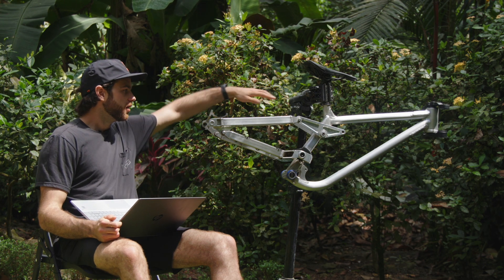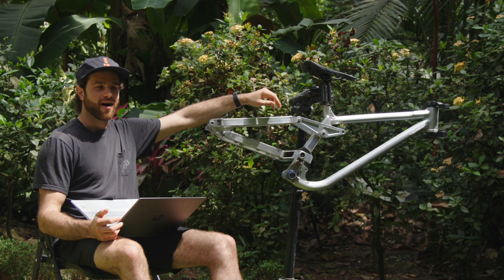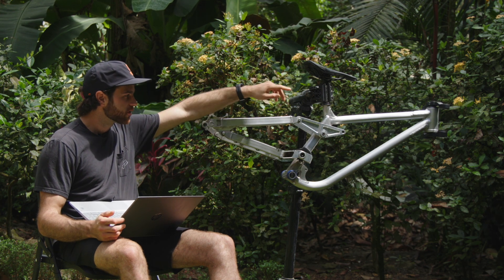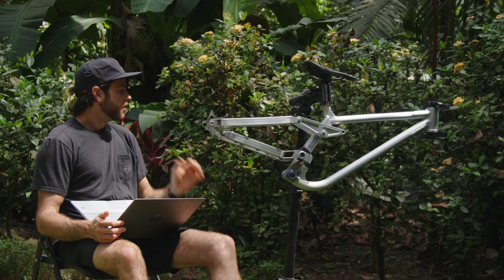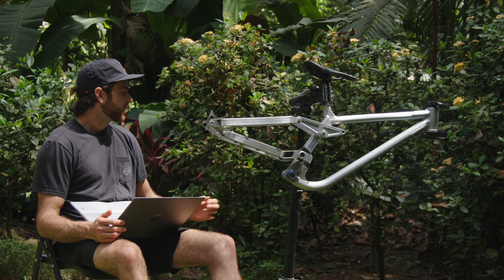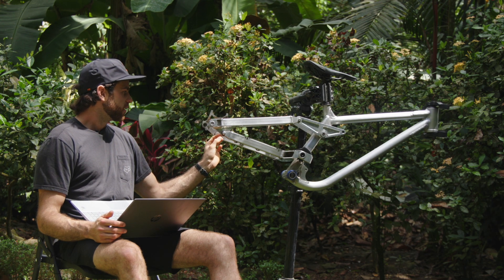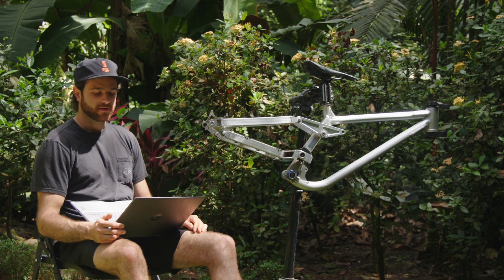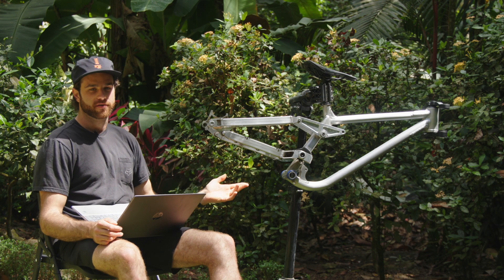The seat stay bridge is here. The links on this bike are the same kind of not-great design I explained from the last bike, but on this one the windows are already closed — we didn't weld it closed — and they're 7075, so it's a slightly stronger material. Other little things like the clevis attachments to the horse link, brake mount, and ISCG tabs were all also CNC machined.